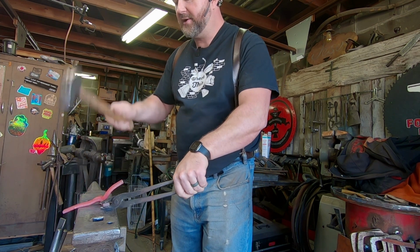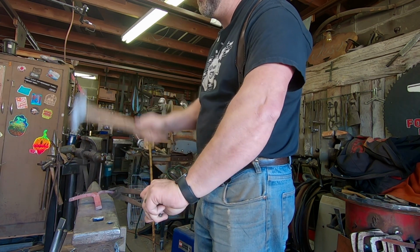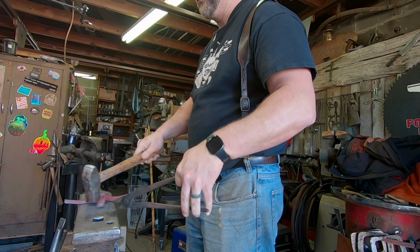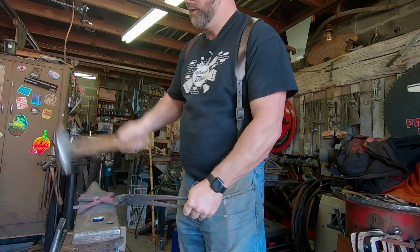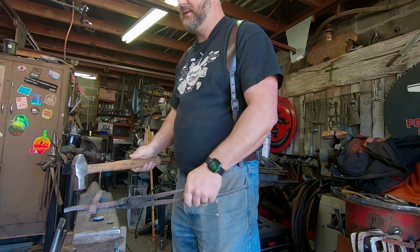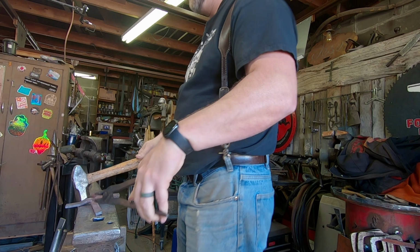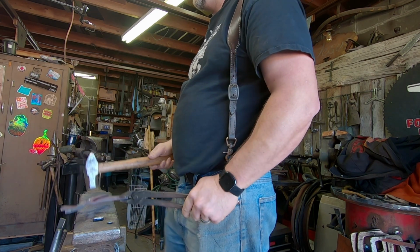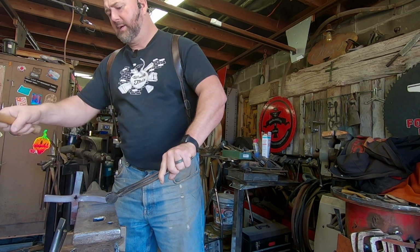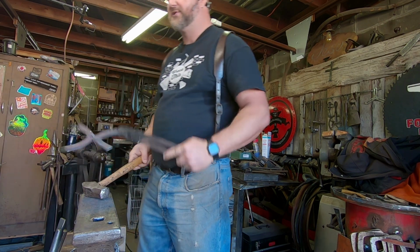You want to hit it in the center. That's naturally what you'd want to do. So I'm tapping this side, this side, this side. There's different ones. Just try to get it open, not wrecking the center. Try to get it straight. It takes a couple times, honestly, without having all the cheating tactics. But you can hang the cross end over the anvil and tap on the other side to straighten her up.